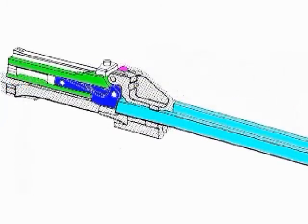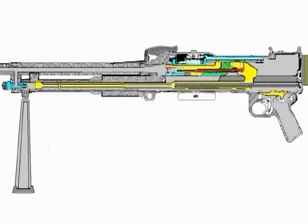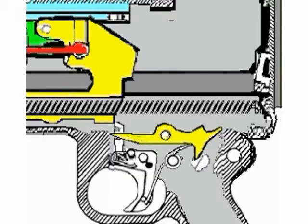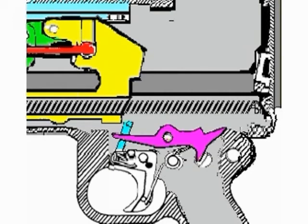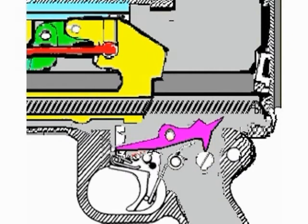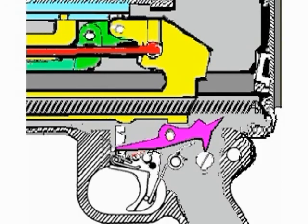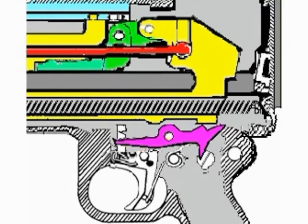Pull on the cocking handle to unlock it, followed by compression of the mainspring. On releasing the trigger, the sear remains down but the tripping lever rises. As the working parts move to the rear, the end of the piston hits the tripping lever, which in turn allows the sear to rise and engage in the bent.